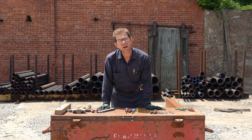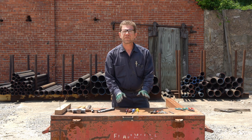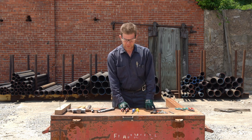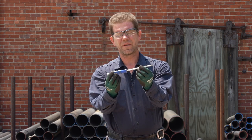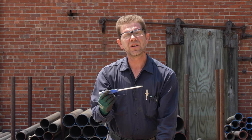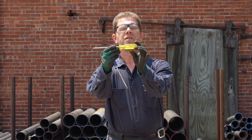So let's talk about screwdrivers. I remember being at somebody's house trying to help them out and I asked for a screwdriver and they said, 'What kind? Plus or minus?' Well, that's actually pretty intuitive. They're actually called Phillips — that's the plus — and slotted or flat, which is the flat blade screwdriver. One interesting thing you might not know: this main piece is the shank. If you'd like to buy yourself a set of screwdrivers, you'd like to have a set where the shank goes all the way through the handle — that adds strength. This screwdriver's shank only goes a fraction of the way through the handle, which makes it weaker.